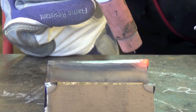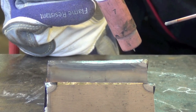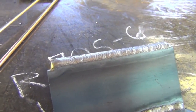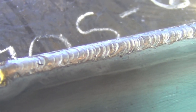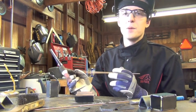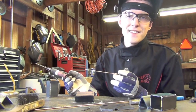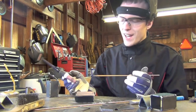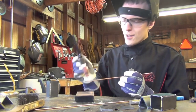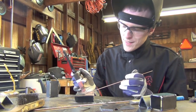There's the finished product. I pretty much just worked my way down the joint and, being that we're using the dip technique, every time you dip that filler rod a new ripple is created. One of the most important bits of advice I'd give a newer welder is to be as consistent as possible as you make your way down the joint — that goes for any welding process, but especially TIG. If you're moving all over the place and not rhythmic at all, you have a higher chance of getting too close and dipping your tungsten.